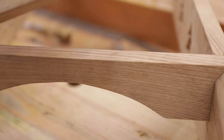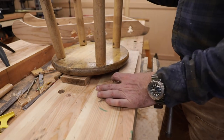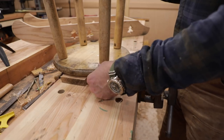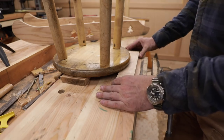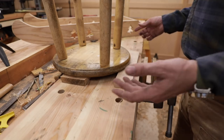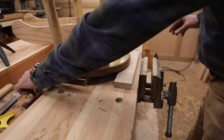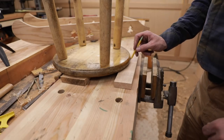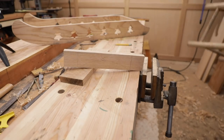Here's the piece we're going to do, and I'll show you how I got this radius — it may not be the best way, but it's a handy little trick I use in the shop all the time. A radius that seems to work for so many things is my bar stool. I've also used five-gallon paint buckets, the bottom of a garbage can, or a lid to get those long radiuses — or of course a compass. I just eyeball it and trace my pencil around it for a nice clean radius. Let's cut it out.